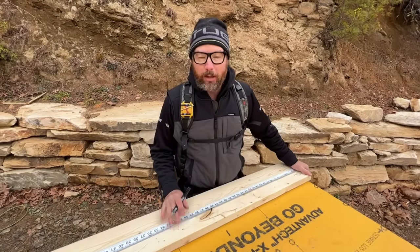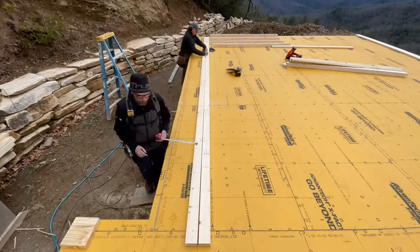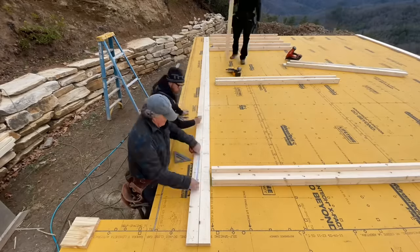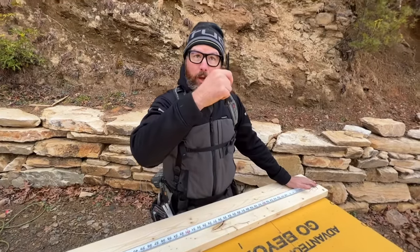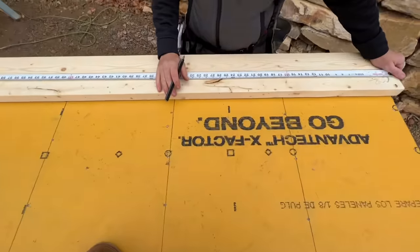There's so much we could say about laying out walls — we can't say it all. But what I will say is we're laying these out on 16-inch center, and that's going to line up with these floor joists. So if we had mechanicals or something that needed to come up through a floor joist bay, they would end up coming up on the stud bay. So what you're saying is the layout on the floor and on the walls is the same? Hopefully — that would be ideal, though it doesn't have to be. The floor is designed to hold the load either way.